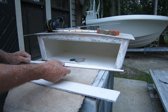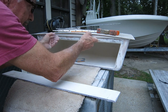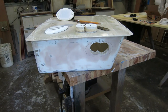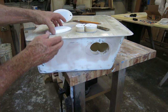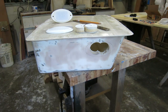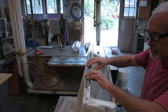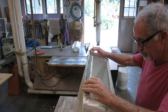I've got my spacer strip cut and cleaned up — back to clean glass — and I'm going to epoxy it right there with some thickened epoxy. That'll stop progress for a few hours for sure. I'm going to mount my horn inside the T-top console so I have to cut a weird-shaped hole. I ended up drilling two holes and now if I straighten these out I think it'll fit pretty well. My fiberglass scrap spacer cured, the glue cured, and I've screwed the top half of the hinge to it and it's in pretty good shape. The bottom is going to be a little trickier.